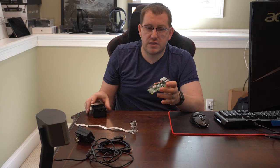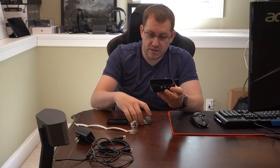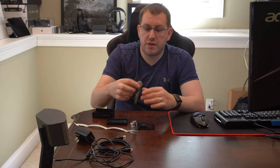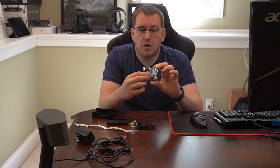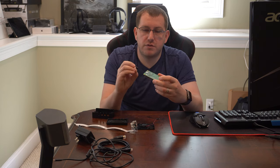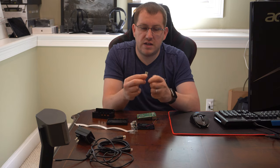Let's go over some of the accessories. I actually bought this as a kit — I'll link it in the description below. It comes with a nice little case and all the heat sinks. If you just buy the Raspberry Pi by itself, you don't get these heat sinks, and they do heat up, especially if you're running anything that's more compute intensive. So it's definitely worth getting those. You also have your SD card slot here — just standard micro SD. You'll need a converter, like an SD to USB adapter, to plug into your computer to flash the image.